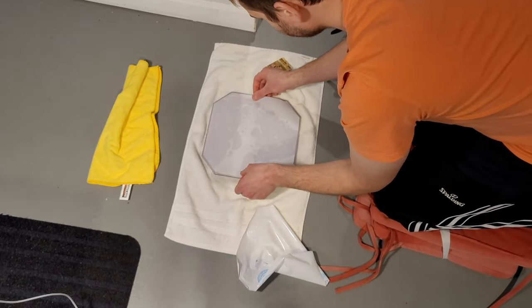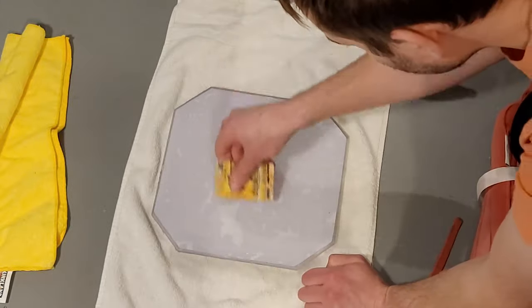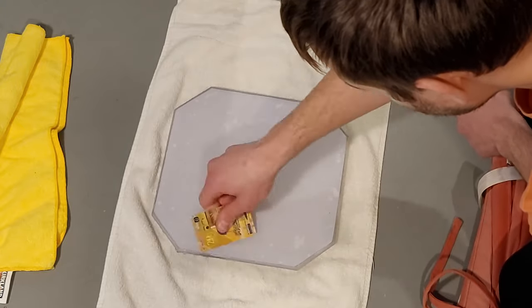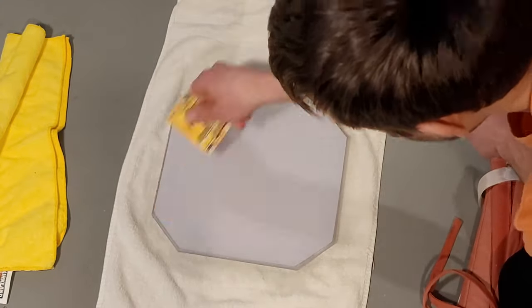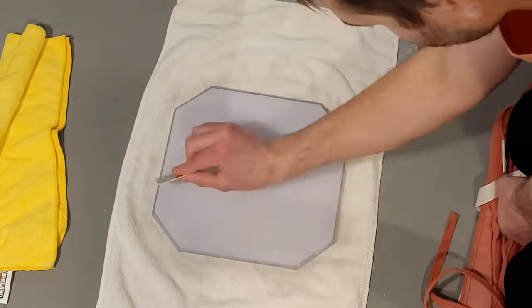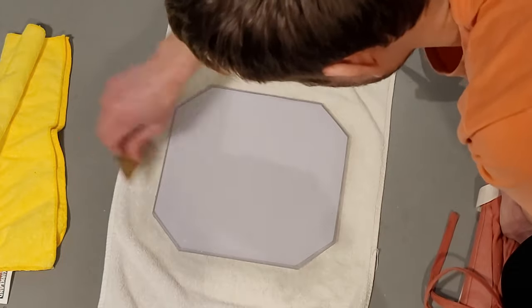I have the advantage here of being able to flip the panel in the future if I want to. But another thing you should keep in mind when it comes to polycarbonate versus acrylic is polycarbonate scratches more easily than acrylic, but it's much less likely to break, and it's a lot stronger. So if you've ever had the problem of a panel cracking, it's likely that that was acrylic. I prefer polycarbonate, but it also means I need to be careful not to scratch my panels.